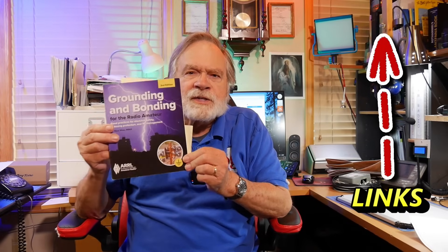Yes, you should go through with the grounding. Even if the rest of the building only has two-wire plugs, make sure your equipment is properly grounded — it could really help you not only in the event of a lightning strike but for plain grounding problems. Grounding is a very specialized subject. This is the book with current amateur best practices: the second edition of Grounding and Bonding for the Radio Amateur by H. Ward Silver, N0AX. It's available from the ARRL or on Amazon. I recommend the hardcover edition rather than Kindle because there are diagrams you'll want to study closely, and you may find yourself underlining things too.